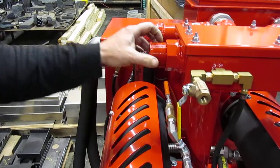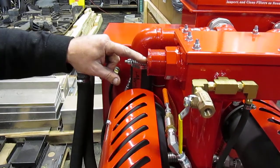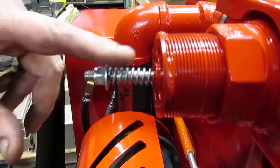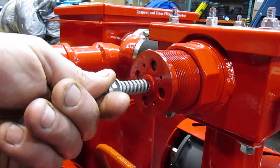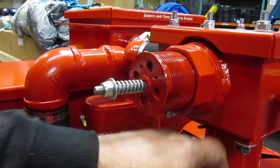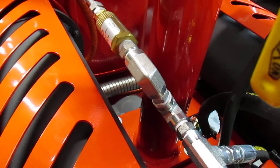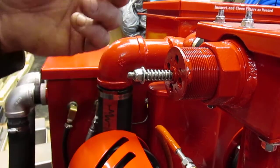Our truck mount basically comes with a two-inch close nipple stainless steel with a laser-cut type of opening. Now, as the suction builds up, it all depends how tense this spring is — it allows some type of air to start getting into the box with your manifold going down to the blower, relieving some of the negative pressure off the blower, so the blower doesn't overheat.